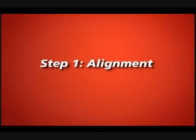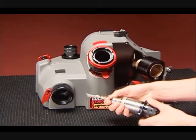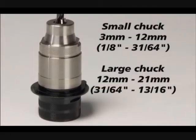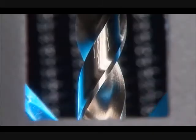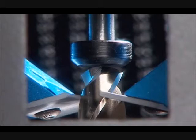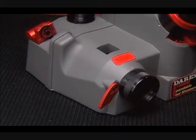Step 1 — Alignment. Insert the drill into the chuck and tighten the chuck knob just to the point where the drill slides in and out. If held too tightly, it won't align properly. Use the appropriate chuck for the size of the drill being sharpened; the diameter ranges are marked on the chuck cam. Align the chuck dog with the notch on the alignment port and insert the chuck. Slowly squeeze the red slide handle until it touches the casting, then verify that the drill tip is touching the pusher shaft cap and the pawl arms are holding the drill across the flutes — this setting determines the relief angle. Firmly tighten the chuck knob, release the red slide handle, and remove the chuck.